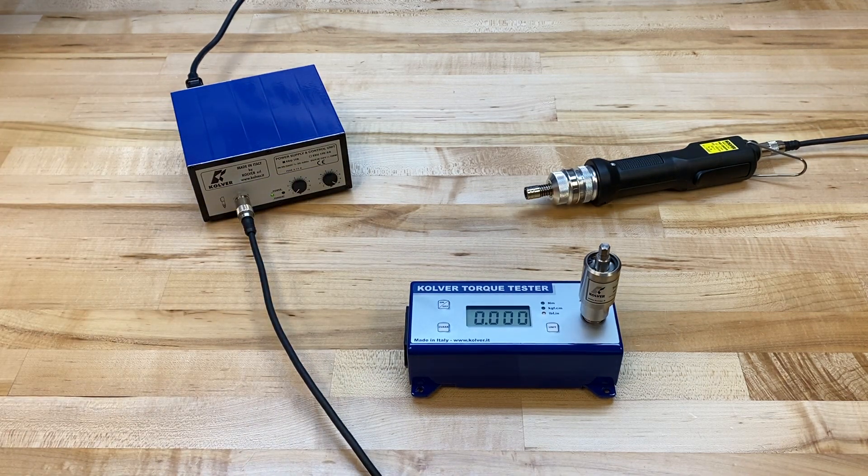It's very important to make sure that no changes are made to these knobs after the driver is put into service, because they directly affect output torque. If you do make changes to the controller, go back and validate the output torque to make sure it's exactly what's needed for your application.